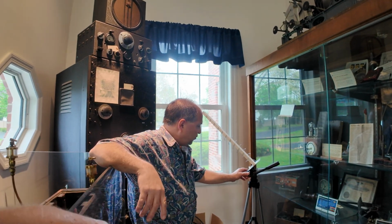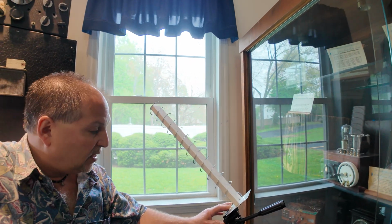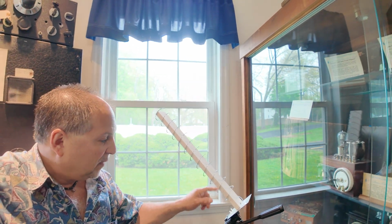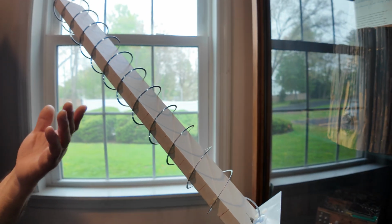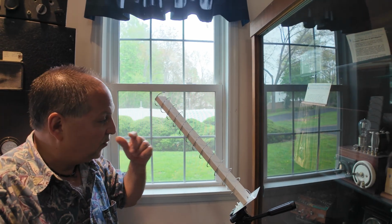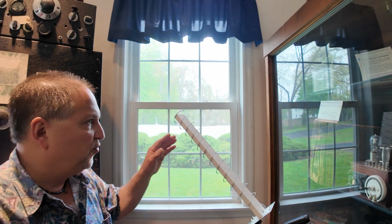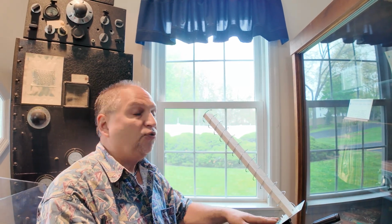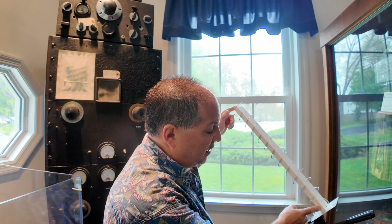For this thing, I had built this to receive the weather satellites, the GOES satellites, at 1694 megahertz. And this one, I'm actually using a metal slinky. I had to calculate this. Thankfully, there are online calculators that, if you put in all the parameters, give you all the dimensions. So this antenna is actually closer to 1640 megahertz, but the calculated bandwidth gets me around 1694. So I could use this for GOES weather satellite. It's a slinky, and I'm using a section of the vinyl fascia.